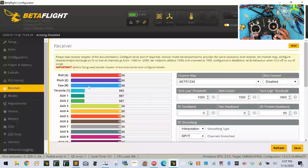All right, now let's go to channel 3. Okay, this is our yaw. We're going to edit the minimum. We're going to crank that up. Oops, that's throttle, my bad. I need to get down to here, channel 4, edit. So we're going to crank that up till it reaches 1000.